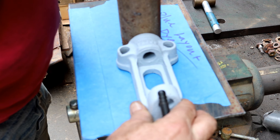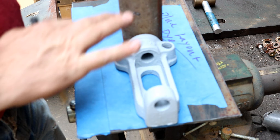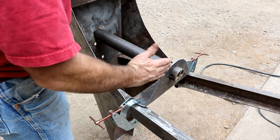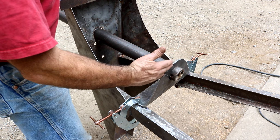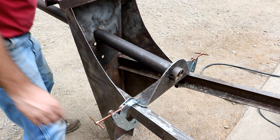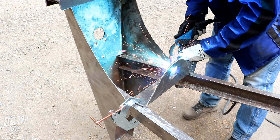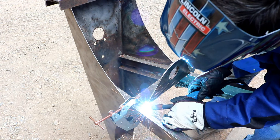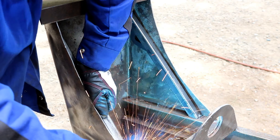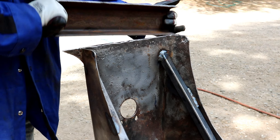I'm going to put that on there — it'll fit in the hole no problem, plenty of room. But this is now almost a half inch higher, so we're going to cut that hole, place it, and probably drill these by hand afterwards. I slipped the tongue in and realigned this, got our distance appropriate so we have enough for the locking pin to catch the hole, and the stop pin will have plenty of clearance. Everything's at angles, so it's all by eye.